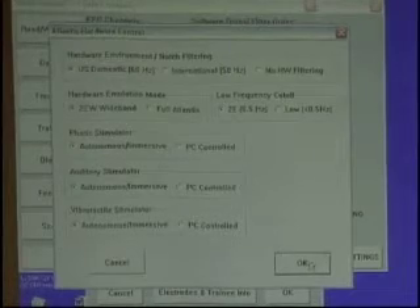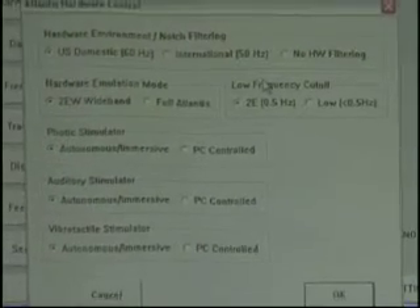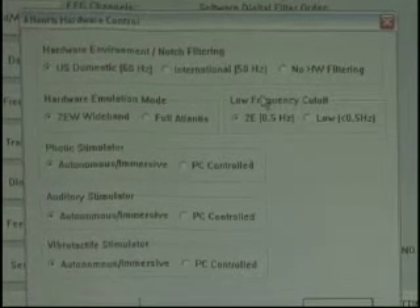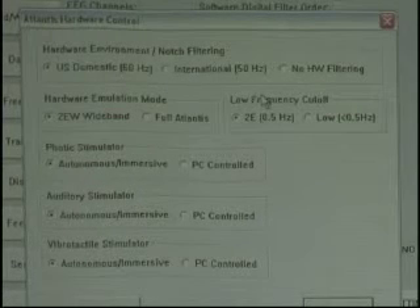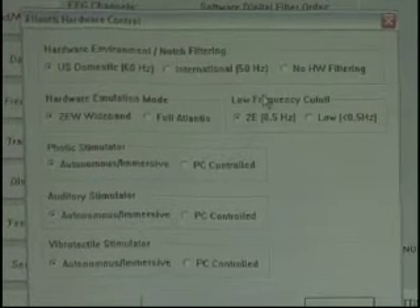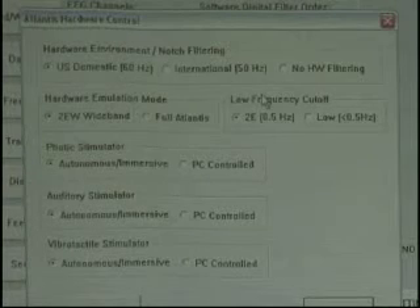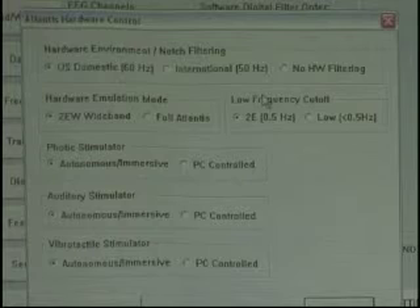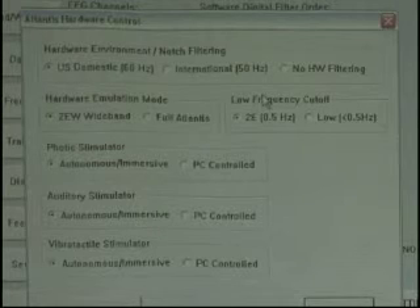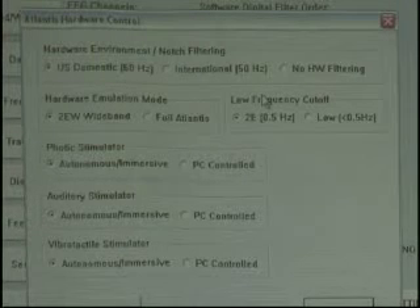How did you just get there? Atlantis Hardware Control, up to the top of data channels. It's USB powered, so it's got to address that right off the bat. Now, it's not redundant — it's different. The reason it's different is the 60 Hz hardware notch is very sharp, right at 60. Every USB device doing EEG or this kind of recording has a hardware notch. The software notch has to do with all the external stuff you're dealing with. This one has to do with its own noise from powering from the PC. That one at 60 isn't bothering anything because it's not filtering anything down the spectrum — it's only a sharp spike at 60.